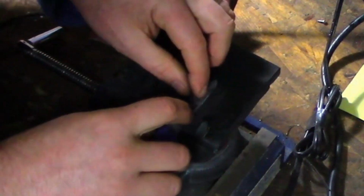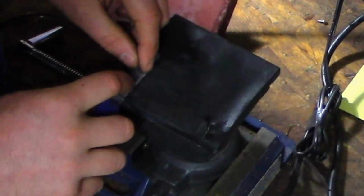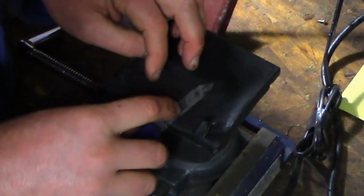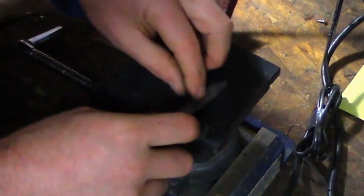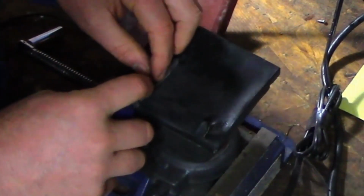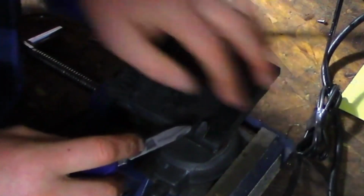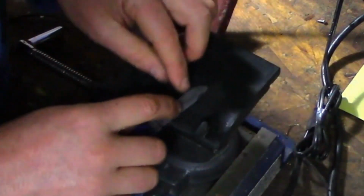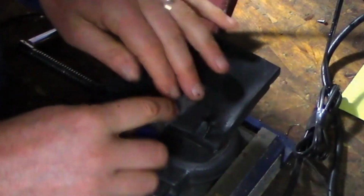So yes, if you pull towards yourself while you're sharpening, you're more likely to create a burr. But that's when you're using a sharpening stone or those wooden blocks. This here thing is a vibrator sander, so it's all over the place. So the direction I'm pulling in, it doesn't matter so much because you can't see. But while this thing's vibrating, it's hitting the edge from all kinds of different angles. So the rules are a little bit different, right? And you can get one of these for like, I don't know, 20, 30 bucks, right?